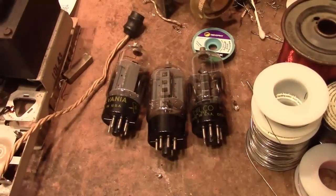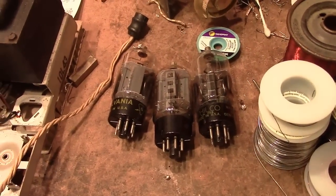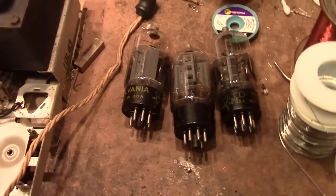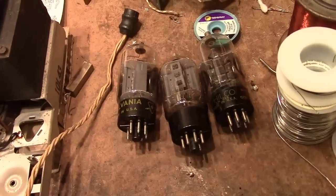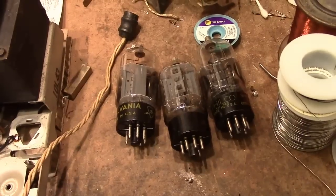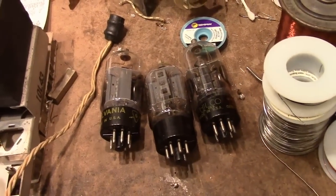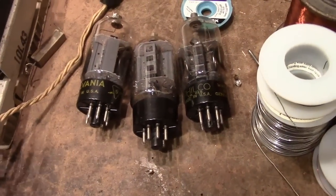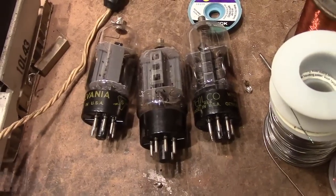Notice how the width slowly increases — just remember I've replaced all the electrolytes here. And there it goes. It turned out that the problem with the high voltage cutting out was a 6DQ6 that, although it tested good and worked okay in the set, after a few minutes of operation something would go wrong. I'm suspecting the tube has an intermittent short that doesn't show up until it's been running for a while. I'll try to verify that later with the tube tester.